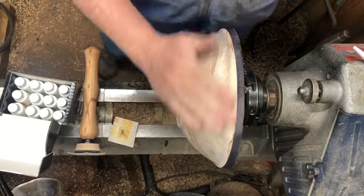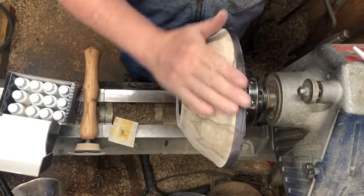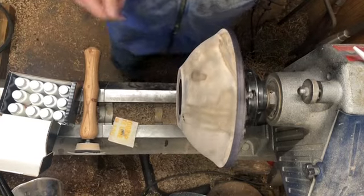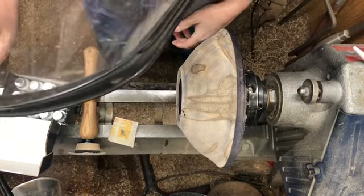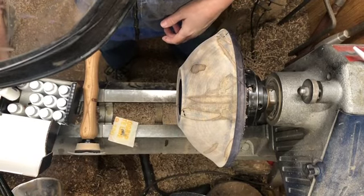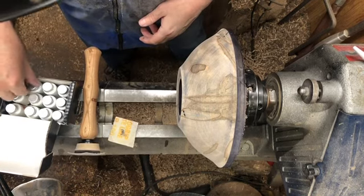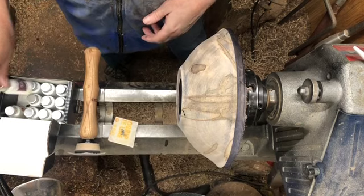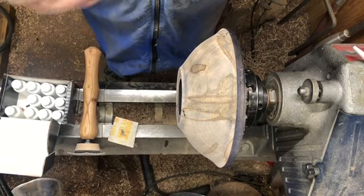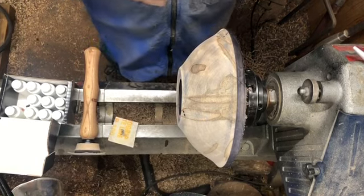Okay, we have covered this with black stain. We have sanded it back with 100 grit and 150 grit. I'm going to apply another color now. Let's go with... I don't want to do what everybody and his brother does. Let's go with some plum. This is a dark purple. Give it a good shake. Make sure our colors are well mixed.